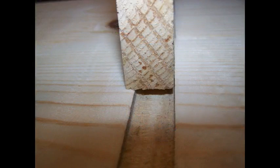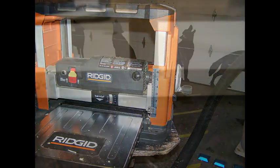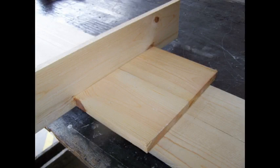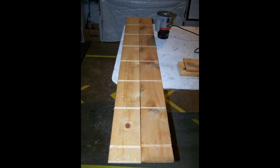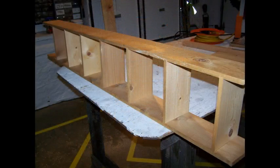You'll notice your shelf board won't fit in that hole — head back over to the planer and plane the shelves down to fit. Now you have a decision to make: do you want stationary shelves or adjustable shelves? The easiest route is stationary — simply cut a scrap piece of wood to use as a guide to properly position your router for each subsequent cut, and in a very short time you're done making all your cuts. Remember the structural shelf: take your outside frame boards back to the closet, put them in place ensuring they're square, hold your center shelf board in place and mark it, then cut it to fit. The goal is to remove the sag out of the side boards. When both sides are square, you've met this requirement and you're completely finished cutting your outside framework.